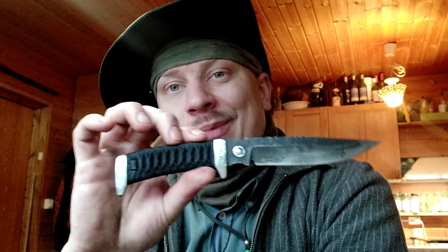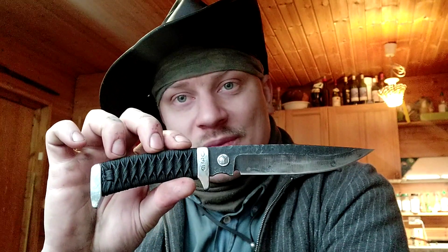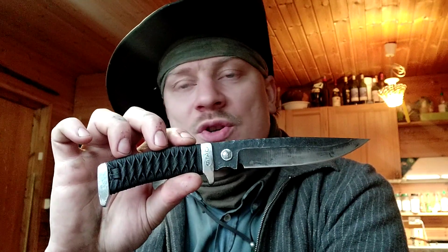Make two or three and go slowly through it, because often you've got a brilliant idea, you make 30 of them and they all have the same problems or a varied amount of problems. By doing it slowly, one or two or three at a time, you measure them, write those measurements down, and tell yourself: okay, this is the minimum dimension in this particular part of this product. You can write yourself a list of standardized dimensions for that product.